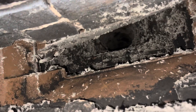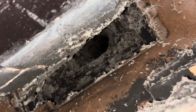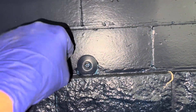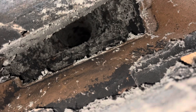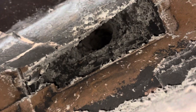Before performing this blower door test, the damper is right there and it's not on the hinge - it's pushed back. No wonder the blower door had to be open for all the rings. That's where the knob for the damper is supposed to be. So before I can perform this blower test, I'm going to have to get my arm up there, put that back in there, and manually close that. You can see the airflow - this is on the second story of the house. There is a stairwell that comes from downstairs and you can see the movement right now, so let's fix that first.